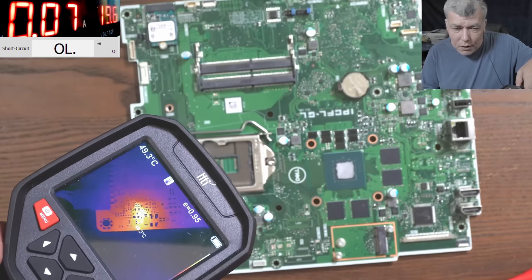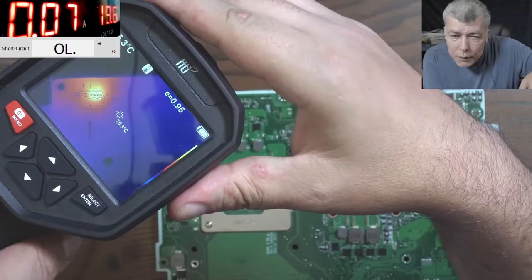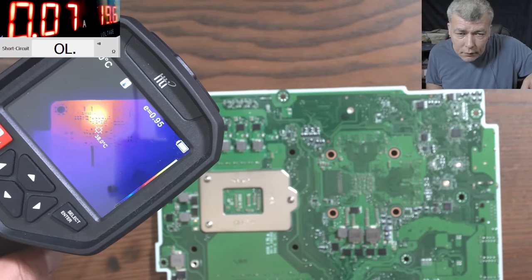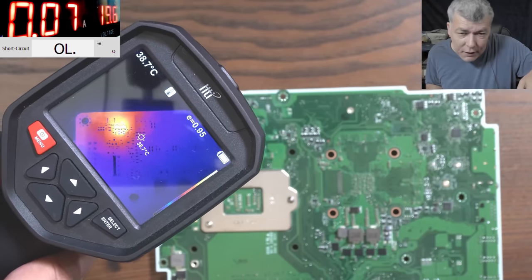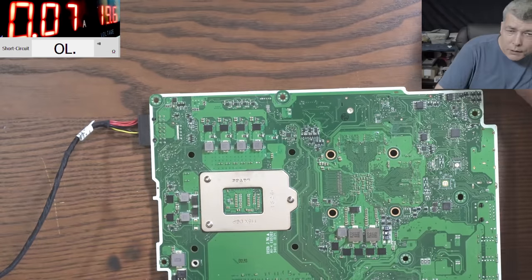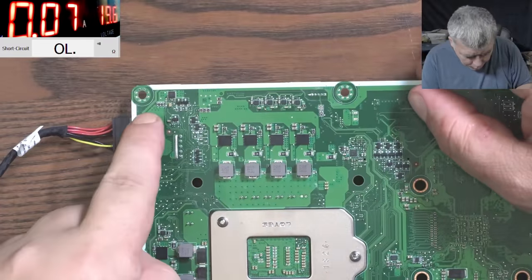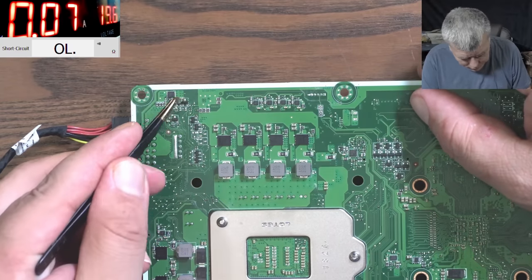Something is hot but it's not on this side of the board — must be on the other side. We have two transistors — normal transistors — and they are very hot. That's the input circuit I can see now. The next MOSFET is probably in series with the power. Check here — the power connector — you can see red, so that must be plus. You have a few inductors then it goes to the MOSFET, and those two transistors are getting hot.